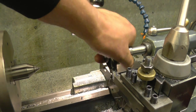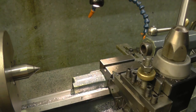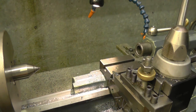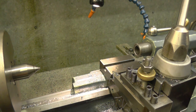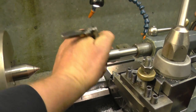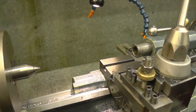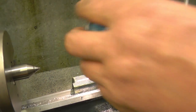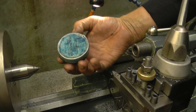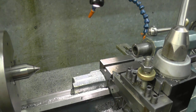That feels good — that's gripping straight away. I can put it in there and it ejects out as well. What I'll do, I'll put some marking blue on. Put it in, give it a turn and see — but it does feel good. I'll put a little bit of this stuff — what I call my Prussian blue. It doesn't take much, really just a little bit like that — it'll go a long way.